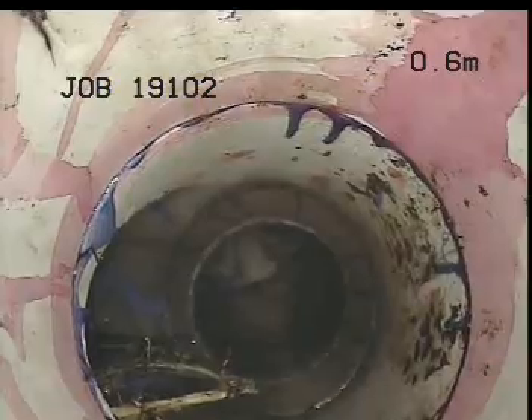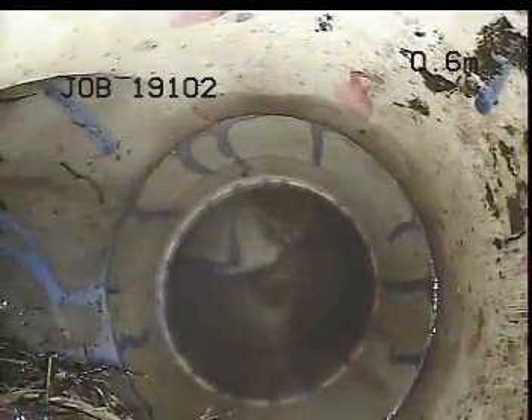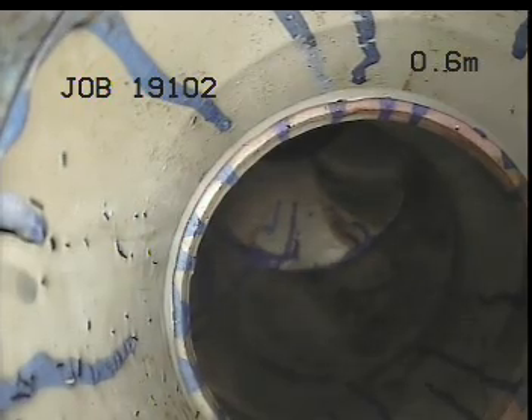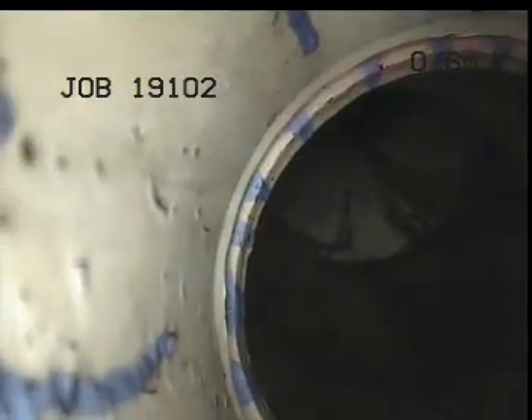So I've just cut out the root as best as possible. There's a little bit of a tail that's sitting there, but the remnants of the actual consolidated root is now removed, so hopefully that'll keep the drain clear for now. But as I said, we definitely need to excavate and replace this junction upstream of the sewer connection.